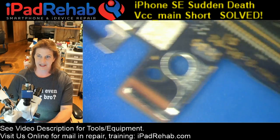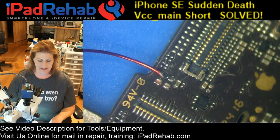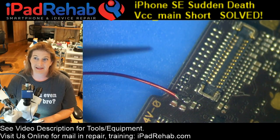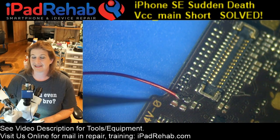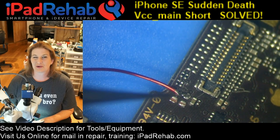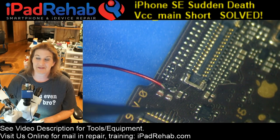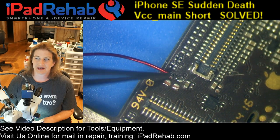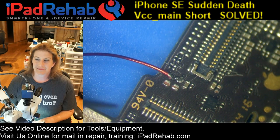All right, so what I've done is I've soldered a wire, and I chose a spot on VCC main that can accommodate a big wire like this one. I like using a big wire if I can, because this wire is not itself going to get as hot as quickly as a tiny wire, so I'm not going to get trolled by my wire if the wire is big. But a big wire doesn't stick on the board very well, so I found a spot here where there are two caps that are on VCC main, and I stuck the wire on both of them together.